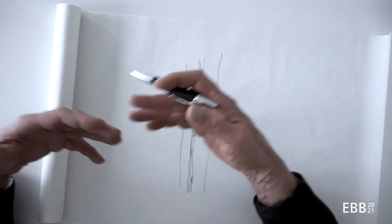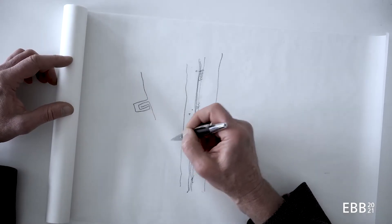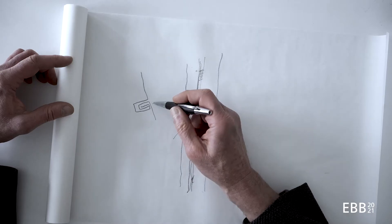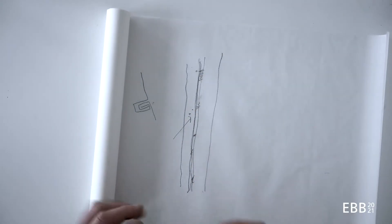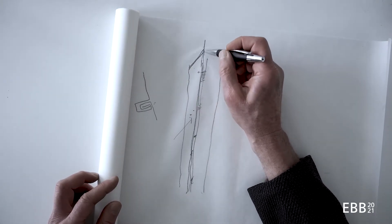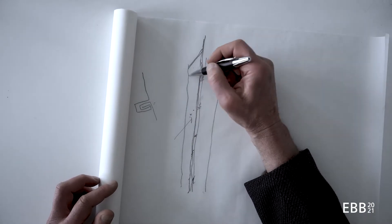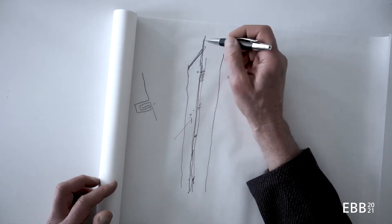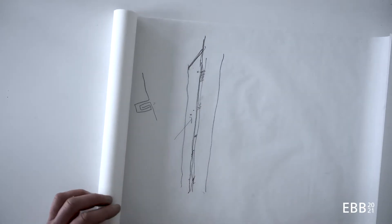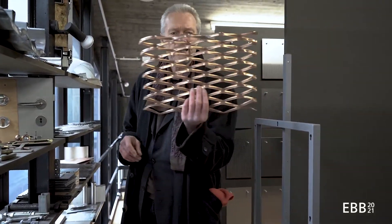The joint between two of these leaves is folded. That's what we see here in elevation. That's one of these folds in side elevation. Often it's terminated like this, turned around and joined with the basic material. And so this is why very often you see these diagonals in sheet metal facades that are mounted on wooden supports. As a siding material, we can use brick, we can use wood, we can use metal as well.